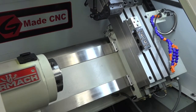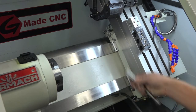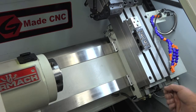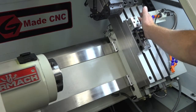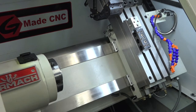Hey guys, welcome back to another episode of G-Made CNC. I had to do some light maintenance on this gang tool setup. What had happened was I was boring a part out with a long boring bar, it was a bit of an aggressive cut, and I noticed some vibration coming in the lower block. So I decided to take it apart and check it. I found I was able to get a half turn out of each screw, and then I went around and checked the lower plate and even the turret — I was getting anywhere from an eighth inch to a little more than three-sixteenths of a turn on a lot of screws. I don't know if that had to do with setting this thing up in the wintertime and expanding/contracting, or maybe the threads just stretched over time.